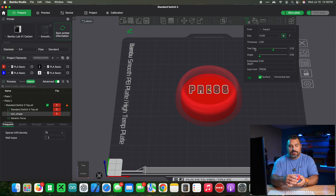This prints basically directly on the surface, and what I've found is that sometimes these letters, especially if you're printing really small letters, can be easily broken off. So to combat that, we're going to actually embed the letters slightly into the surface of the switch. That's what the embed depth setting is for. Our layer height is set at 0.16 millimeters, so we want a multiple of that. Two layer lines worth would be 0.32 millimeters.